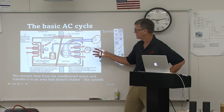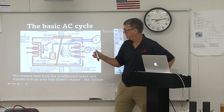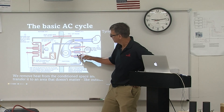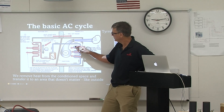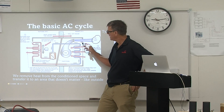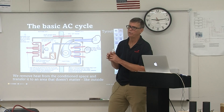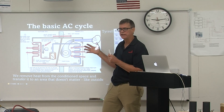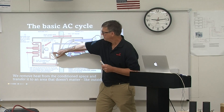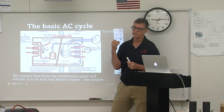We're pushing out 55 degrees, which means we have absorbed about 20 degrees of heat in BTUs. After that happens, we should see about the same temperature across that coil in latent heat. But by the time it leaves the coil, it is sensible heat again. As that sensible gas starts coming back, we are actually superheating that gas because it's nothing but a gas now. By the time it gets back to the compressor, it is very important that this is nothing but a gas.